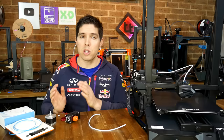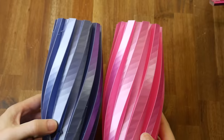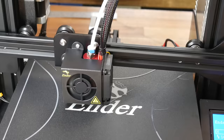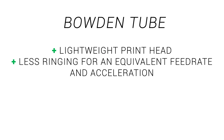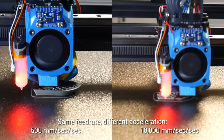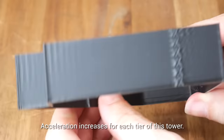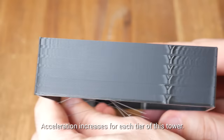With that out of the way, let's start to explore strengths and weaknesses, beginning with the Bowden tube setup, which is very commonly found on new 3D printers where achieving good quality isn't really a problem. The major strength of a Bowden tube setup is the lightweight printhead. In a Bowden setup, the moving mass is kept to a minimum — the printhead only consists of the hotend and a part cooling fan. Here we see my Rat Rig printing with the same feed rate but vastly different acceleration: the higher acceleration provides a much more violent movement. That fast movement introduces vibration, which comes out in the print as ringing. The lower we keep this mass, like with a Bowden tube, the less ringing we should have.